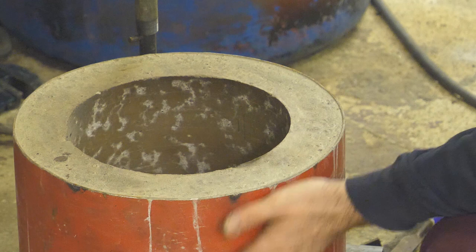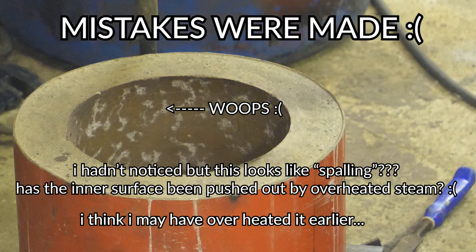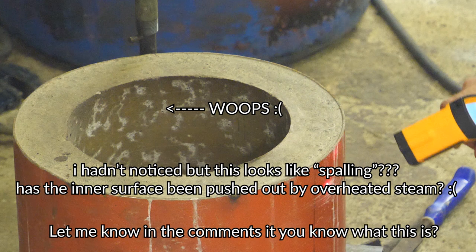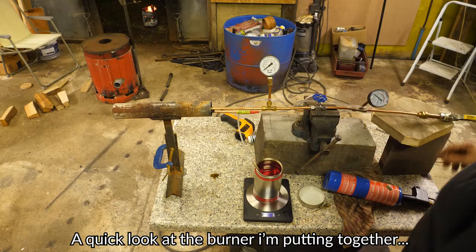The outside is lovely and warm, so I'm assuming it's going to get warmer as we go up. Halfway up the void — halfway up exactly — 124°, so I'll stop that. About an inch from the top: 122°. And the surface: 98° at the top in the middle. Right on the edge: 108°. On the metal side: 90° at the top. 95° halfway, and around floor level: 56, 57. So I've got an air line here and it's at 60 PSI — about medium to high pressure — and it's off at this needle valve. That's the diesel line, set to zero grams.